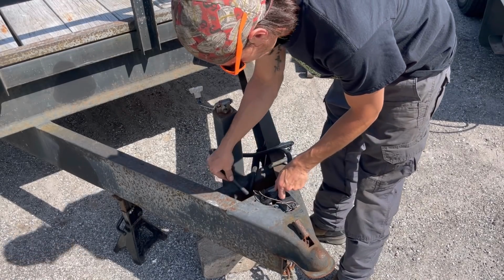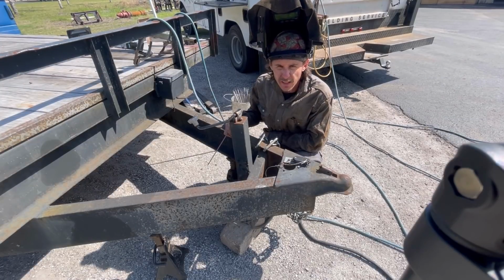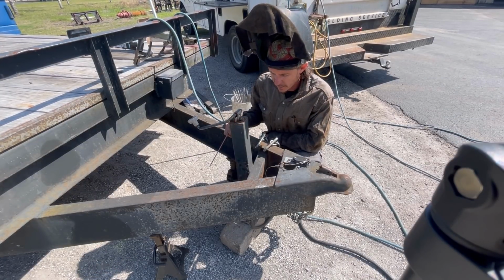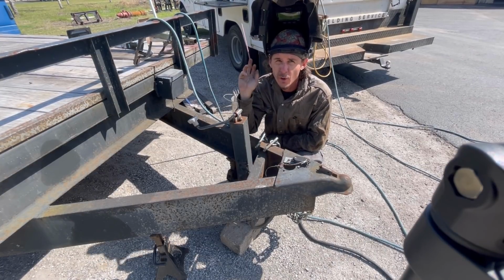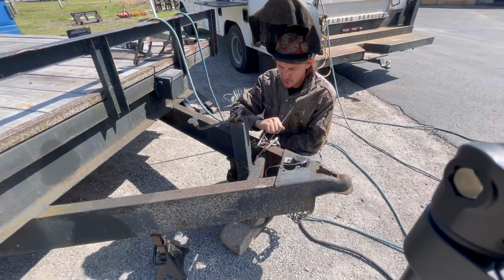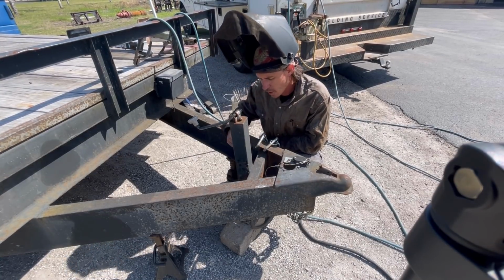All right, so we'll get all the wire out of the way, get everything that can burn out of the way first. We're doing an old trick an old boilermaker taught me. What you wanna do here is take a 6010 and turn that welder way up, to like 220 amps, and push this weld out of here with the 6010. It's gonna be a lot easier on the downhill stuff, and that's where I'm gonna start first